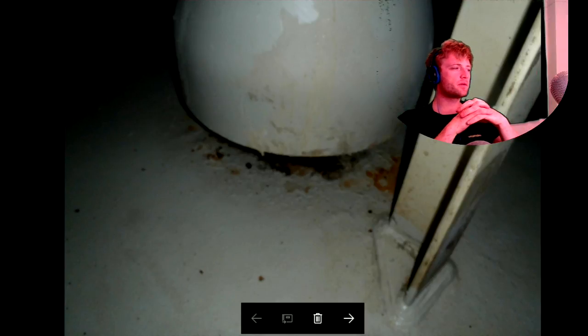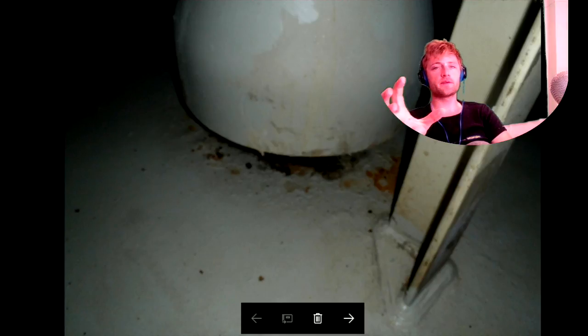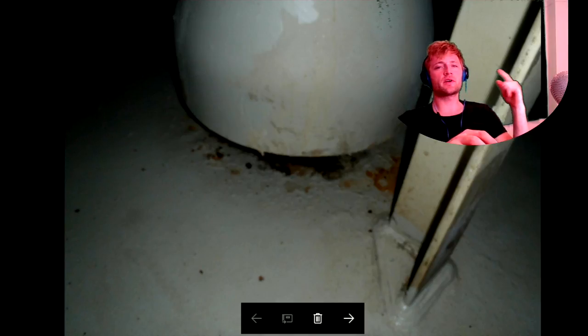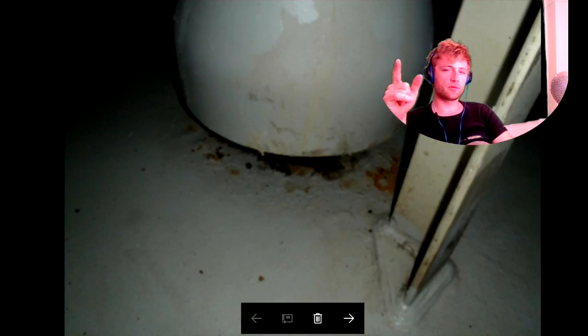Normally it's number one, which is located on the starboard side, and is connected to this pipe and this valve. The proper way to use this emergency suction valve is: first, close the suction of the pump, increase the vacuum on the suction side of the gauge, and then open this valve to be sure that suction will be done.